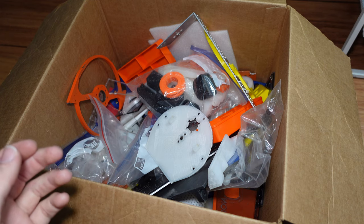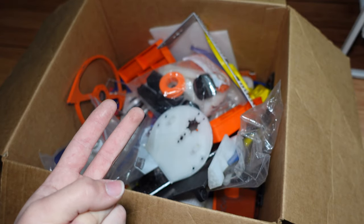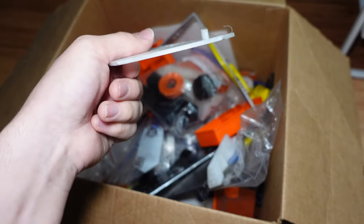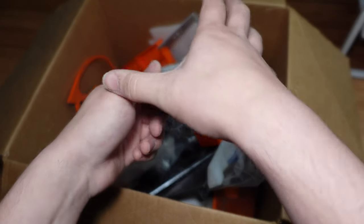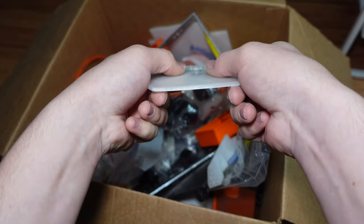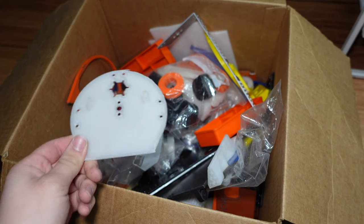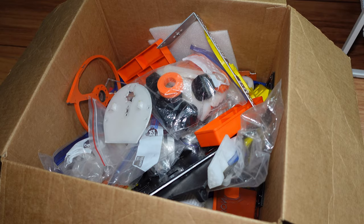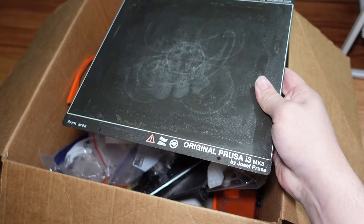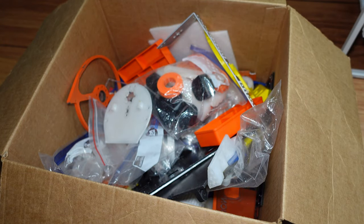The tricky parts about nylon are primarily that you need to print it at a higher temperature, and it warps significantly. If you can't get great bed adhesion or just have complicated part geometry or not very much surface area, it's really easy for that to be a problem, especially if you're trying to print like a whole robot chassis. The bottom part on the heated bed is expanded because it's hot, but as it goes up, the part is cooling and trying to pull in, so the chassis will just start to peel up. One of the reasons I decided to get the Sidewinder X2 as my second printer was to see if having a glass bed that can't just peel off the heating surface might help deal with some of that warping.